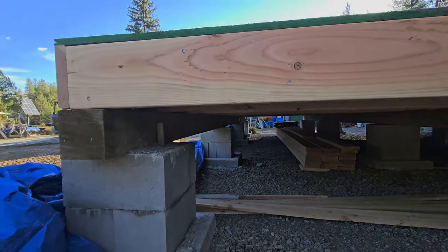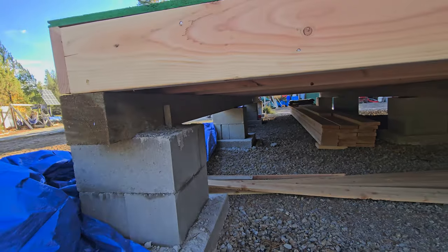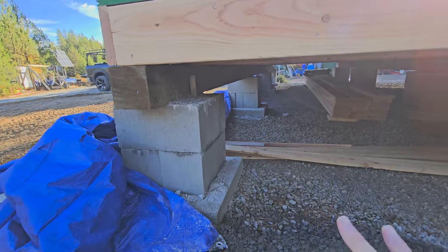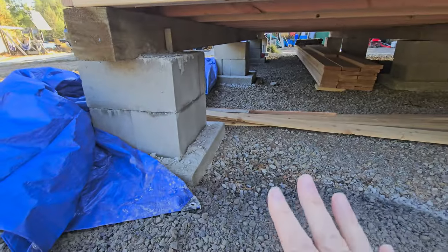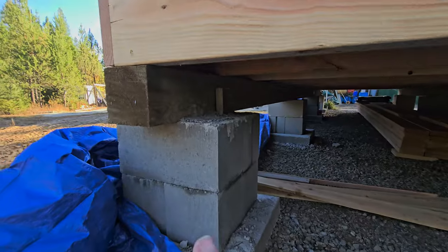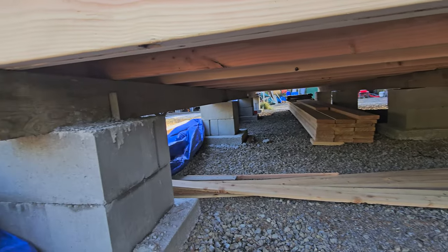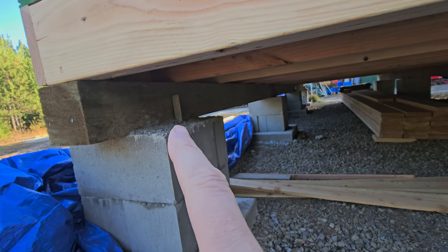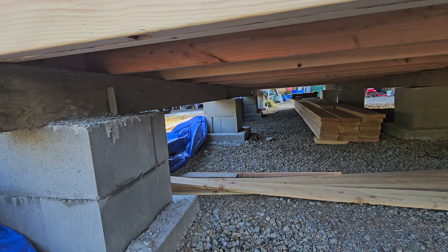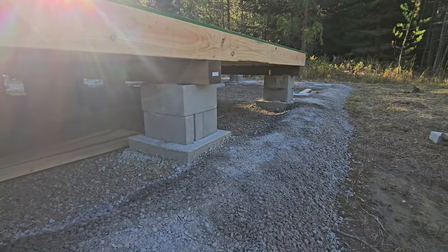Some things that we're really happy that we did — why did we build it like this? It's because the ground we have here is very similar to the Alaska ground in the fact that it will heave. There's moisture in the ground. So we built it like this for two reasons: one, it'll move when the ground moves; and two, by building the beams on top of a pier, we can easily jack and level the cabin throughout the years. All we have to do is unscrew this from the beam if ever needed, and throw some shims in here. The floor is secured to the beams, and this worked out really, really well.